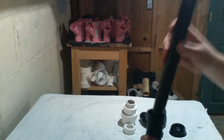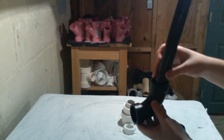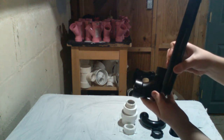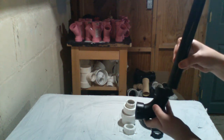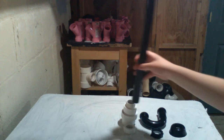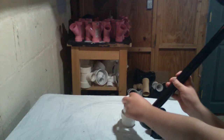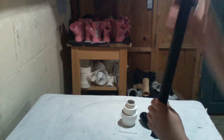When you're sliding this down, if you hit something you're hitting the bottom of an elbow, and if you hit the bottom of an elbow you could restrict the flow. So make sure you trim this if you ever feel it stop — you can use the old one for measurements. In my case my pipe goes straight down pretty far so I don't need to worry about trimming. Make sure you save your old slip nut that was under the old escutcheon.